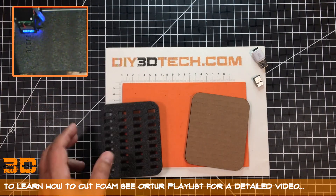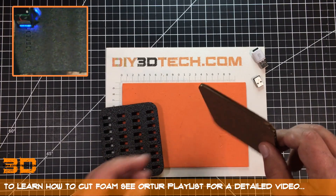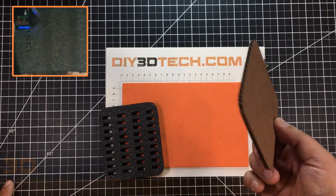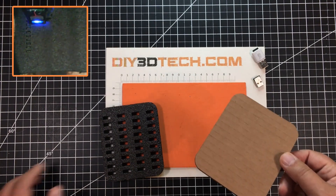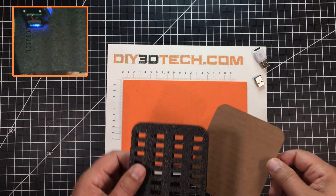It's a little short of 15 millimeters thick. Then I used this piece of three millimeter cardboard — about 10 millimeters a second with about 15 passes. Kind of crazy the number of passes you need to cut out cardboard versus this foam.